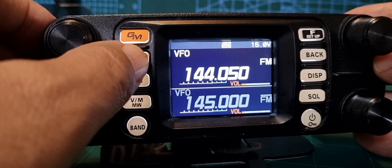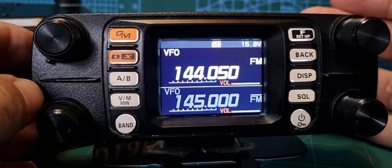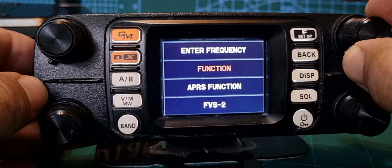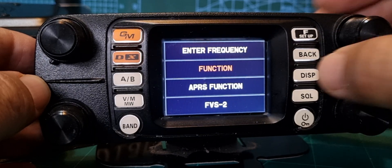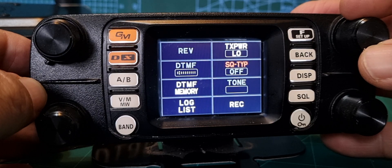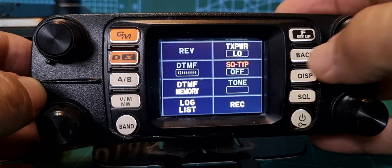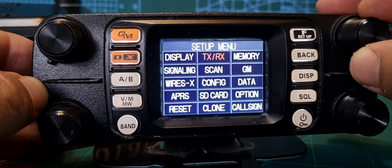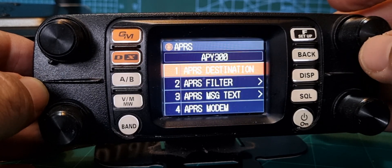You have to go into the menu to enable voice wide, but I've never seen anyone use voice wide on an FTM-300. You've got two lots of menus: the short press menu shows APRS and the voice unit menu. You can manually enter a frequency by pushing the channel knob. Push function then the channel knob for the extended menu — you can change power, squelch, tone, DTMF, and memory settings. The main ones you'll use for memory channels will be signalling and config.